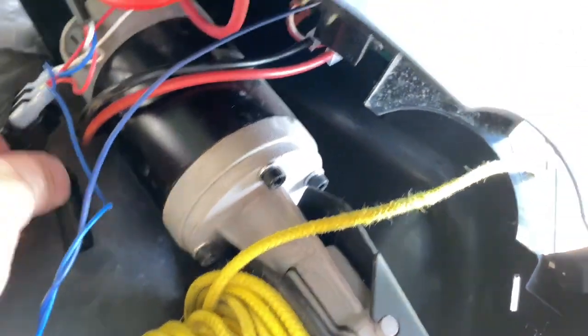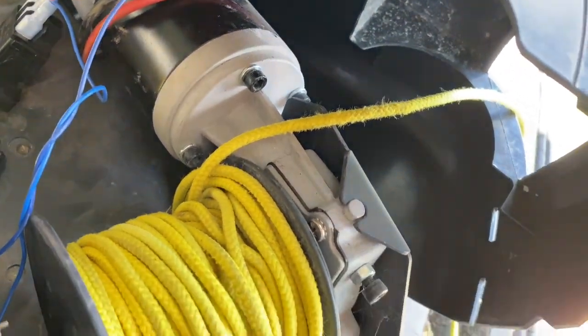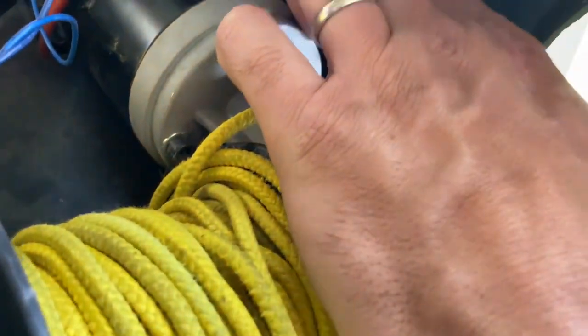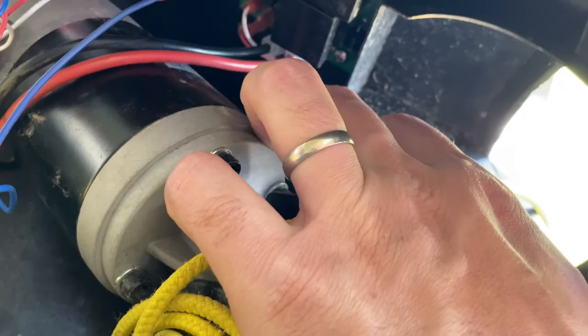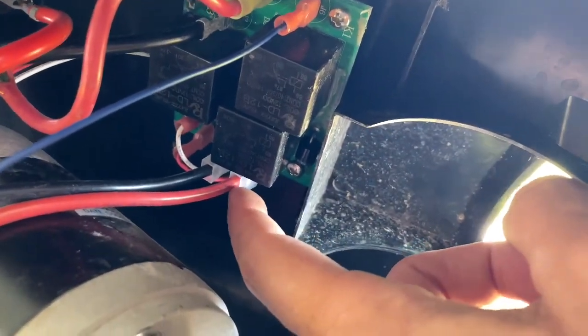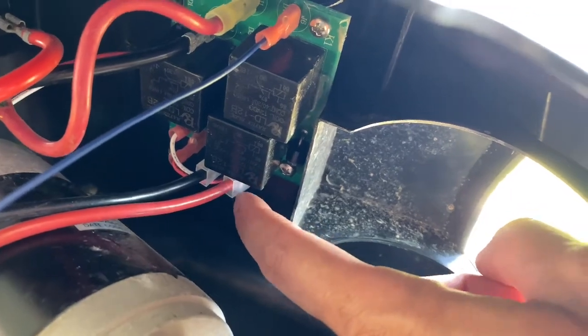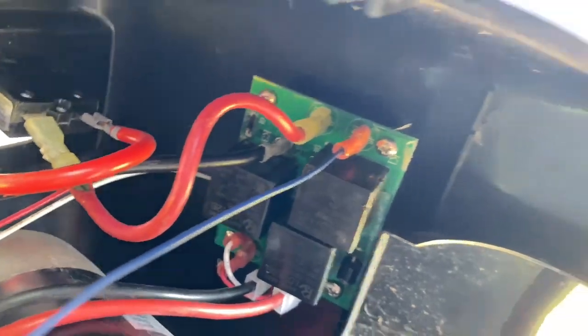This is kind of a preliminary check for you guys to try to figure out on your own what was wrong — just basic troubleshooting. We're pressing the switch, the relays were clicking, so I'm guessing there's something wrong with this board. I also have to make sure there's voltage on the output of this. I'm going to take the four screws off here and look at the bottom side — could be a solder problem.